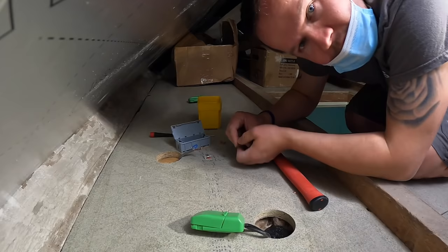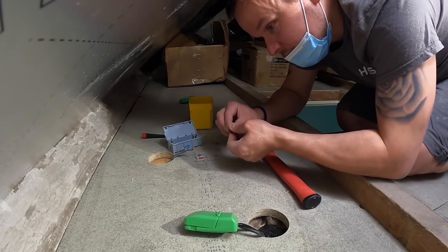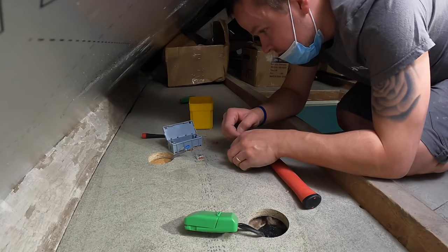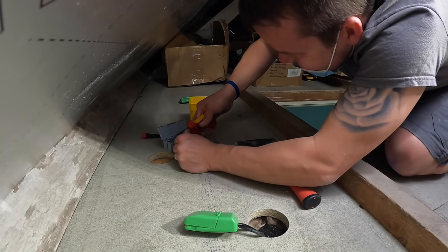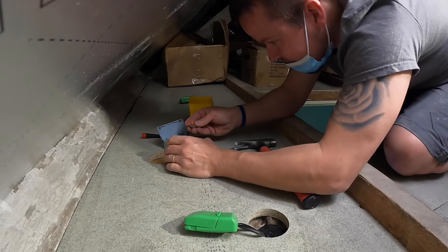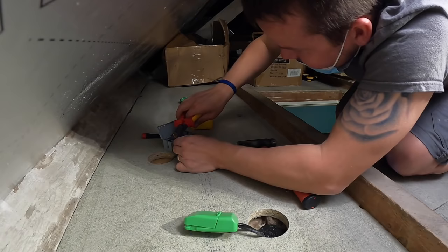Right, I've just got set up now. James got me everything. This is the original feed that comes up, where it's a switch feed and a neutral. What I need to do, just because we're isolated, but I don't want to trip the RCD off, and everyone gets a bit confused when I say that, it means that the RCD will still sense an earth to neutral fault because it's always connected. So I'll get my Wago's on there and there.